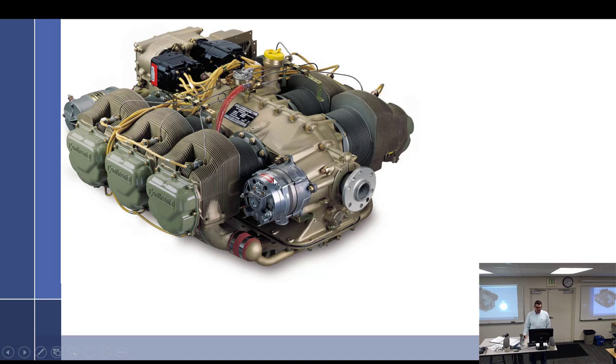When you have this integral drive, it's called a permold case. If you took all the cylinders off and just looked at the case, you'd notice that one cylinder hole on one side is a little bit smaller than the others. They also talk about the seventh-stud engine — actually it's a ninth stud that goes right dead center in the middle with a little extra plate. There's the permold engine with that feature versus the sandcast which does not have it — that's something they expect you to know.